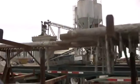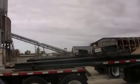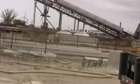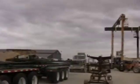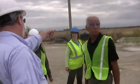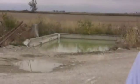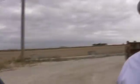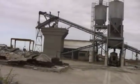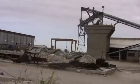Remember I told you we recycle our water? The trucks come over to this little pond over here, and you see the different bins? They wash out all the trucks and everything else over here, and then when the water gets up to a certain height, it'll roll over to the next, and then keep rolling over, and once it gets to the very end, it'll be clear, and then that goes right back into the pond. How long have you guys been recycling the water? That's about 2 years now. We used to do just a one-stage thing. What do you do with your backwash? It goes into that area. The backwash goes into one of the bins and then just keeps recycling over. It's got little portholes in there that keep all the solids on one side, and then the clear water goes over here. Clear water is a misnomer. You wouldn't drink it, but you can use it to make concrete.